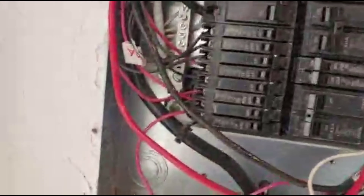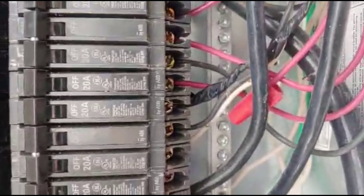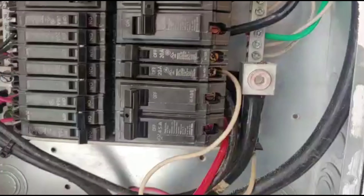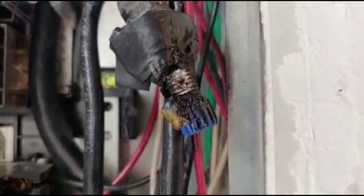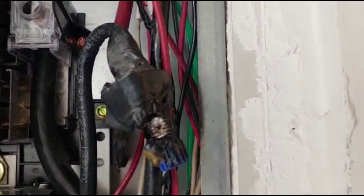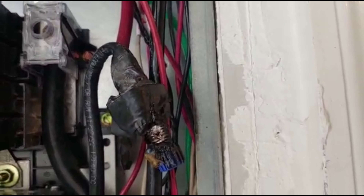These people are really not pleased with what I'm seeing. You have the one ground sharing — I mean, you say it's up to code but it's weird. You have a lot of dual-pole doing mixed circuits because they're sharing the return. Anyway, to make a long story short, the breaker kept tripping and once I opened the panel I noticed why. I went to the roof and everything was good there.